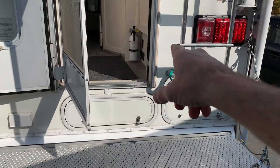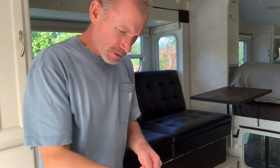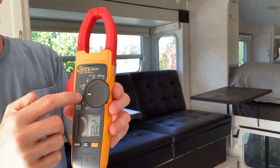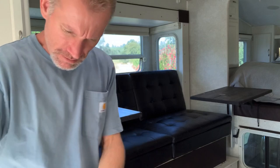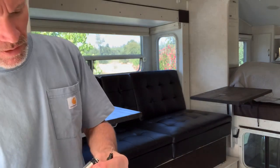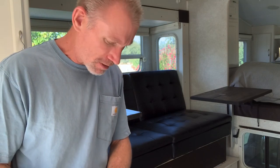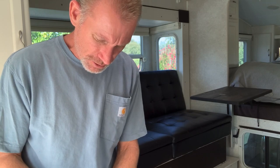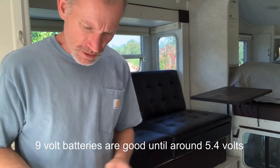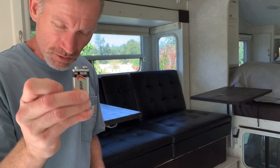So I'm going to put my meter on the switch and on where all the wires go into the main controller under the stove. Make sure your meter is set to DC — there's AC and DC. Take your leads, take the battery out of your remote control. On the battery itself there's negative and positive; put the red lead on positive. This battery reads 8.5 volts DC — it's still good. A brand new one would probably read around 9.2 volts, but 8.5 volts is still a good battery.